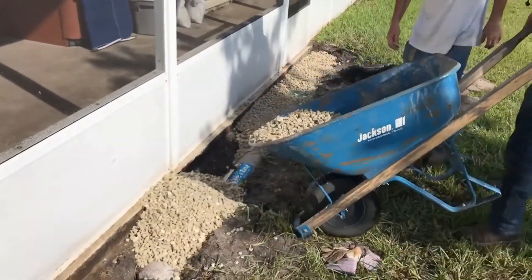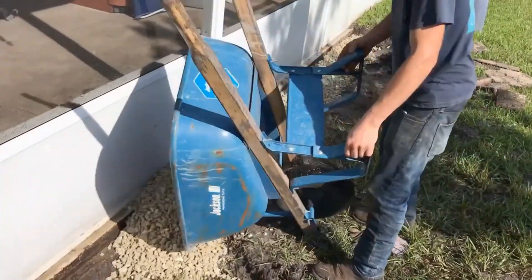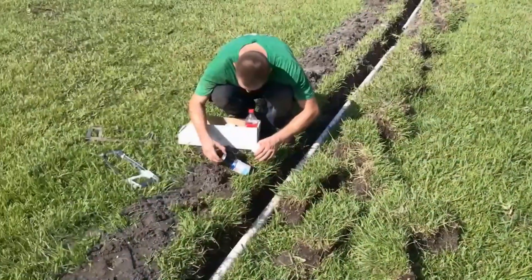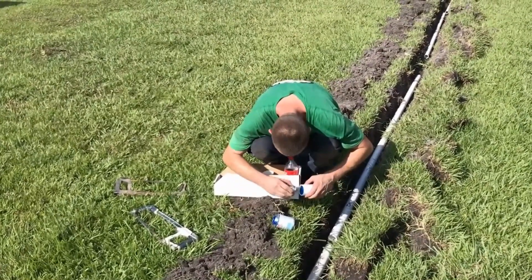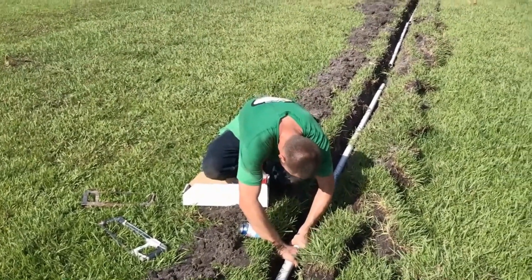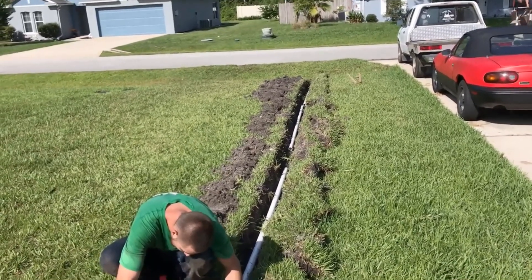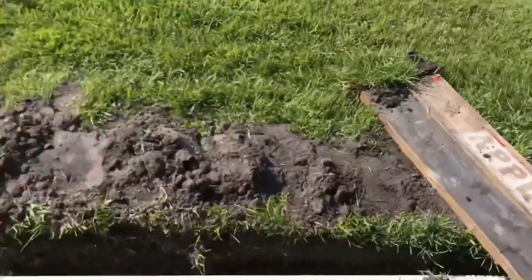Really the hardest thing about this job is just moving gravel around. Once you get it back here it's pretty simple — use your shovel and spread it out. Remember we're bringing gravel to grade so all the water will just go right through. Each fitting has to be glued; we're using an all-in-one medium-grade cement. We only have a few more pieces to go, then I'll show you how to set up the discharge. We use a three-inch grate because the pump is so powerful it would blow a pop-up apart, and we secure the grate with a screw.